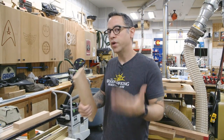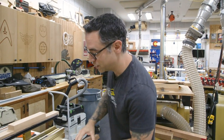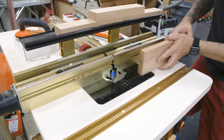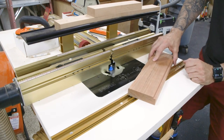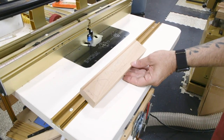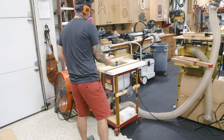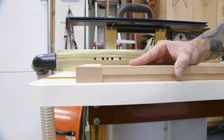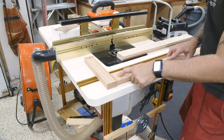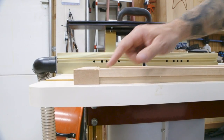While the rails dry, we put a bead on the inside edge of the stiles — a nice little rounded-over bead for visual flair using a beading bit already in the router table. This is part of Rockler's kit, perfectly made for this purpose. One additional detail: where rails meet the beaded stile, a square corner looks rough, so we put a slight chamfer on the end grain of the rails. When brought together, it mimics the other side of the bead profile. Very elegant.